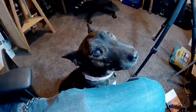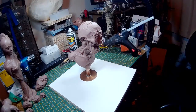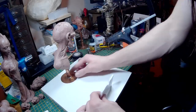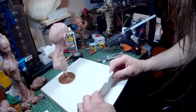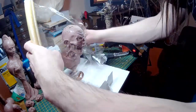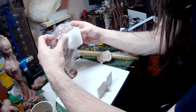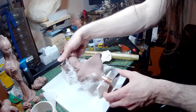I've got some help from Lola who's going to be helping out throughout the video. What I'm going to be doing is taking the sculpture and suspending it above this piece of wood and then building a clay wall around the sculpture. The first step is to cut some foam board to size to help position the sculpture, hot gluing everything together. I'm also going to be using water-based clay to build the clay wall, so I'm putting a layer of cling film over it to keep things clean. I've decided to lay the model face down and taped some bubble wrap to the front so it doesn't get damaged.